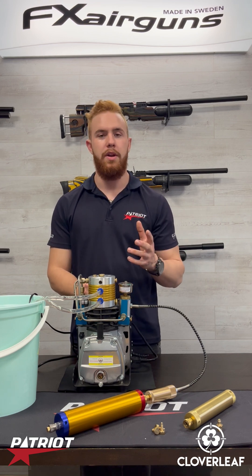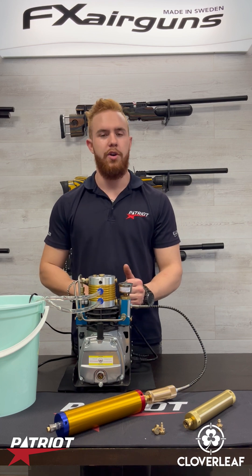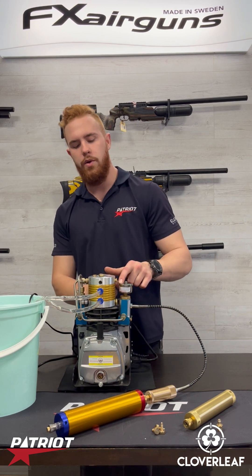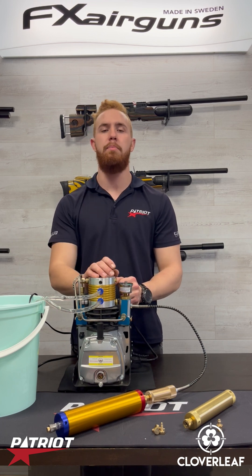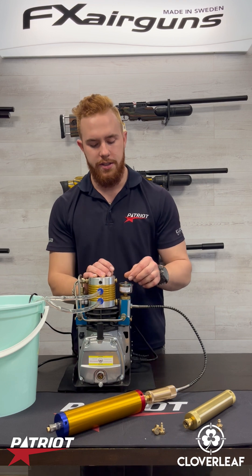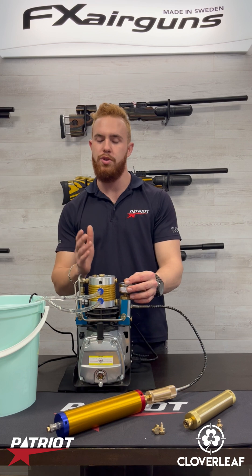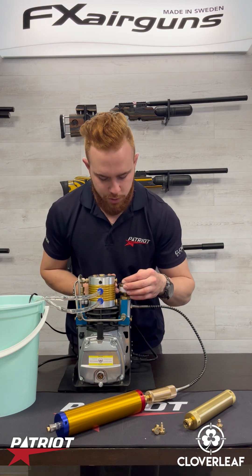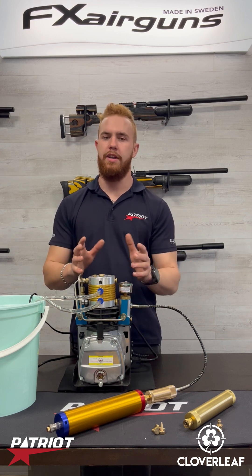When I got here this compressor was about 23 degrees, but once I turned the cooling on it dropped below 19 — so we're starting at a good temperature. There's a gauge that shows you where you're filling to and how much. Please keep in mind this is a 310 bar compressor, so don't go past 300 bar. You'll also see a dial you can set to choose when you want the compressor to automatically stop charging — for example, set it to 250 bar. It will then automatically shut off, which is a nice safety feature, but please do keep an eye on it.